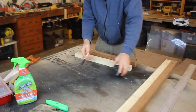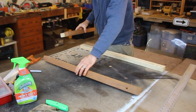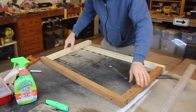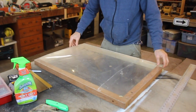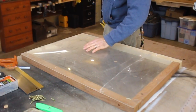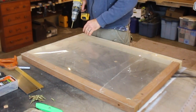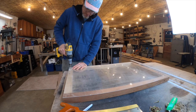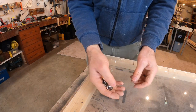Once the wood is cut, mock it up and see how it works. The two horizontal pieces go on the outside, the two vertical pieces go on the inside. Put the clear acrylic on top — perfect. Now you could pull the acrylic off and attach all the wood together, but it's actually faster to just screw the acrylic to the wood first. It holds everything in place, and then you can attach the pieces together — and this is where you use the finishing washers.